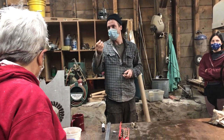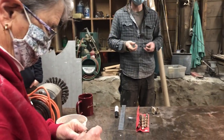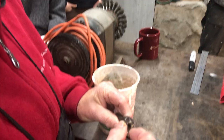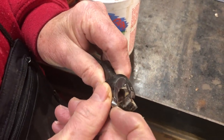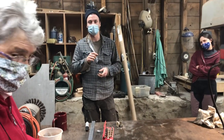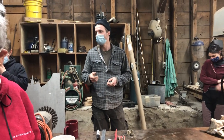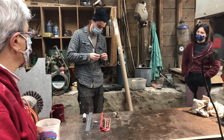And when you have small bungs, they're not going to go into the holes well, especially if you're using wood glue, which is my personal preference because it comes out easy. Then it's going to be sloppy in there, and they're going to fall out. You have to let the glue dry before you can clip them, all sorts of other trouble.